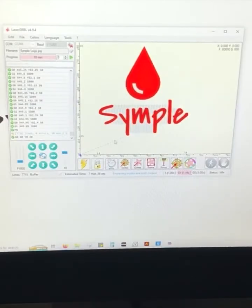With the preset saved, we're going to move on to the leather patches — we're going to engrave leather patches. The settings are a little different, and for everything you do you're going to need a trial patch or a piece of cork to figure out what setting works best for you. The height of the laser plays a big role in getting the perfect burn.